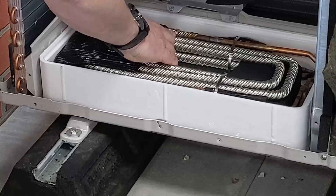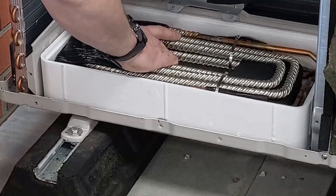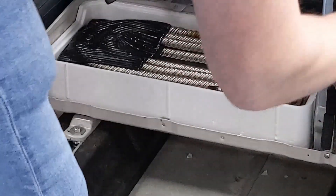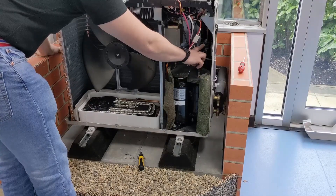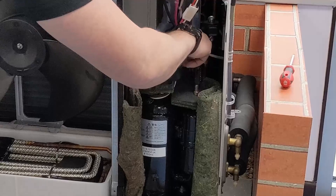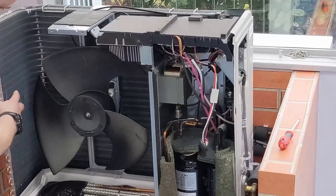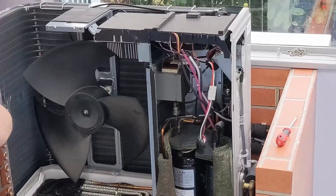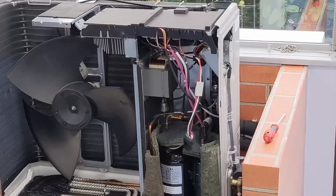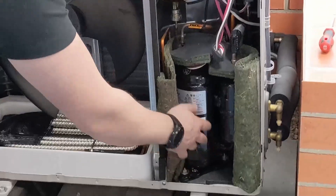The refrigerant pipework is soldered into place to give good thermal transfer, making a very robust heat exchanger. As refrigerant passes through that tube-and-tube heat exchanger, it goes from being a gas to being a liquid as we produce that hot water. Refrigerant then passes off to an expansion device, taken from high pressure to low pressure. It then passes onto that coil, where it boils from a mix of liquid and vapour back to vapour, and then passes back from the coil into the compressor to start all over again.